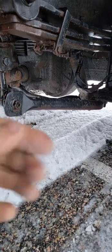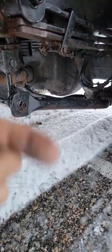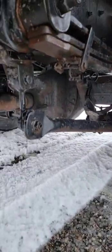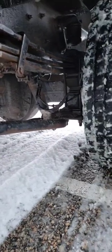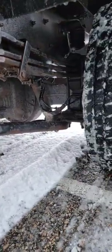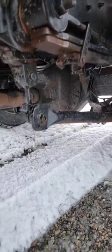There's probably 30-some splines in there and it's just slipping inside the splines — that's what I think is going on. It's a hefty rear end to just let go. I pulled off 169, took a left-hand corner, and BAM — I thought the whole frame broke in half. It banged and bowed and it was popping and cracking.